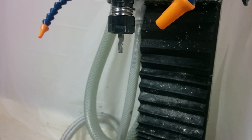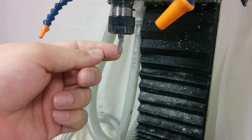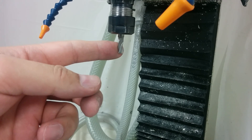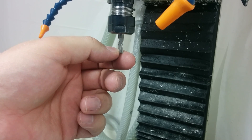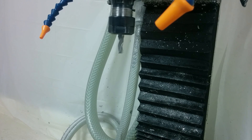Just a short video before I hit the sack. I wanted to show you these 7/32" end mills I've got — they're carbide 3-flute with a low helix angle, but they've been working really good in aluminum. I'm getting a really good surface finish with them, surprisingly. I wonder if they're regrinds because I got them so cheap. It's a quarter-inch shank and I bought them on Travers — I subscribe to their email list and get their hot deals, and these were 90% off.